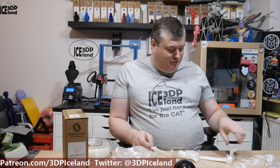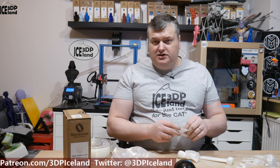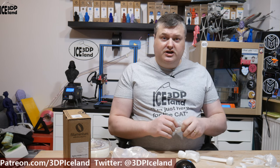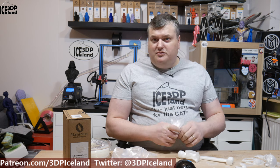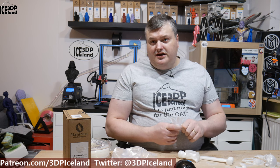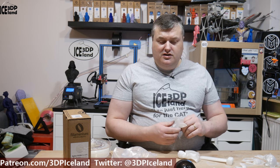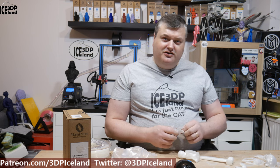As you can see me smashing up my models like I normally do — now with this new roll that is brand new and doesn't have any moisture issue, I was able to get excellent prints and excellent layer adhesion. The problems I had before no longer exist. Maybe it was my fault not to dry out the nylon before the previous review, because if the spool was old and wet I was not using the material correctly. I've read about nylon being sensitive to moisture but didn't have any real experience with it before, so this is a learning process for me.